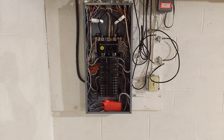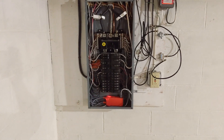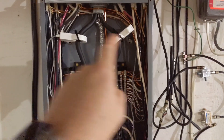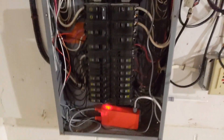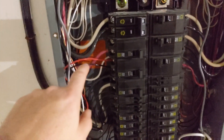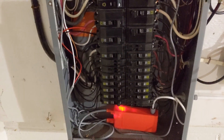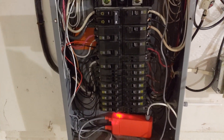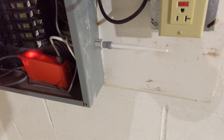Installation was relatively straightforward. Though I recommend you use a qualified electrician to install your unit, I did install mine myself — I do have an electronics background. Basically, inside you'll find these clamps and you need to clamp one to each leg of the electric coming into your panel. There's also another connection: you have to power it with 220, so I just tied it to an existing breaker. The instructions say to use an empty one or a small one if you have it. My panel is relatively full, so I just tied on to an existing breaker for now. The unit itself has an antenna wire that comes out — you just poke it through the side, and that is your Wi-Fi connection.